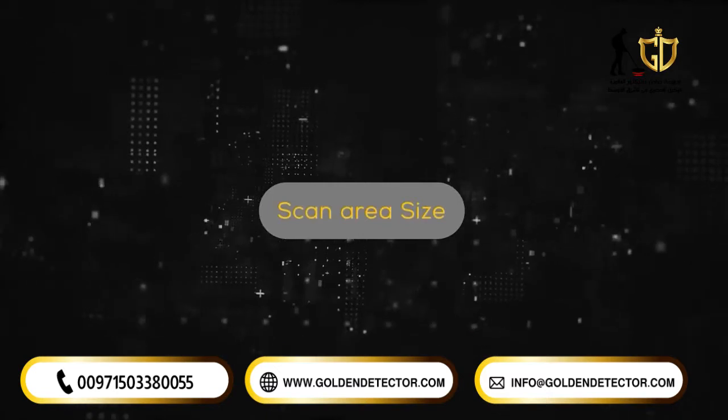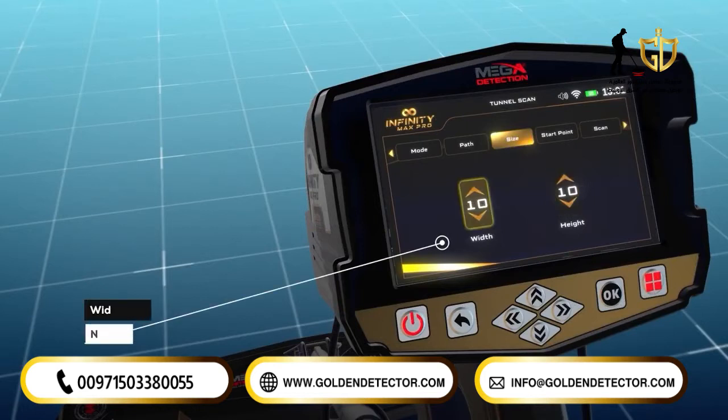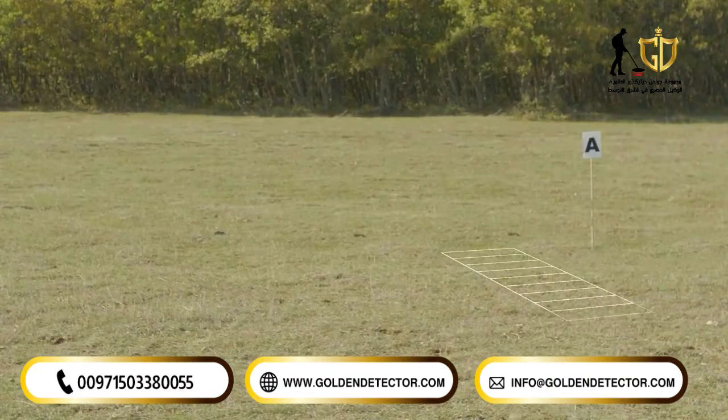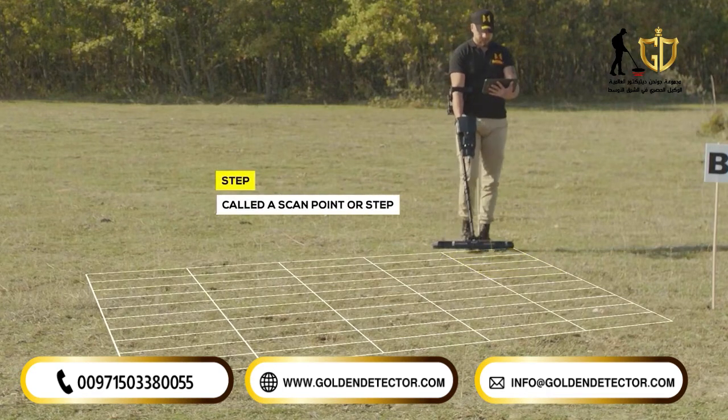Scan area size. The user can choose the dimensions of the scanning area using this screen, which are width, lines. It's the number of scan lines, and can be set using the up-down arrows. Then press the OK button. Height, steps. This number expresses the number of scanning steps, or points for each line, and it can be changed by using the up-down arrows and then pressing the OK button. To understand the difference between lines and steps, look at the following figure. When the user stands straight in the search area, every step he takes forward is called a scan point, or step.